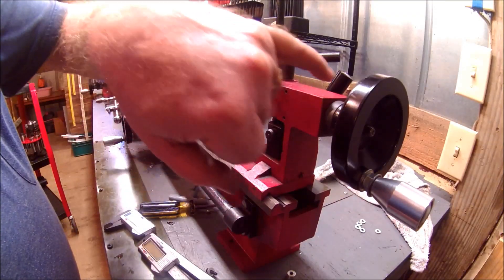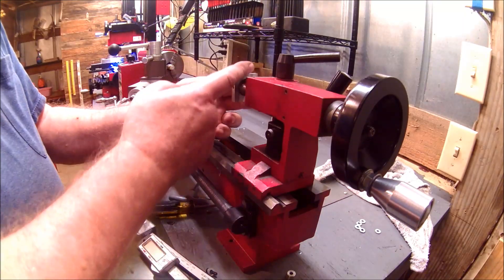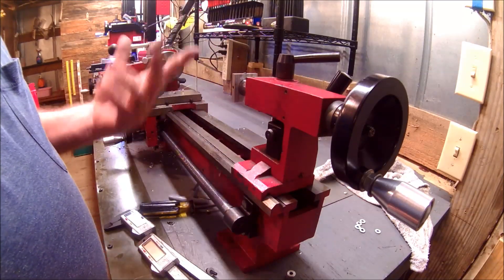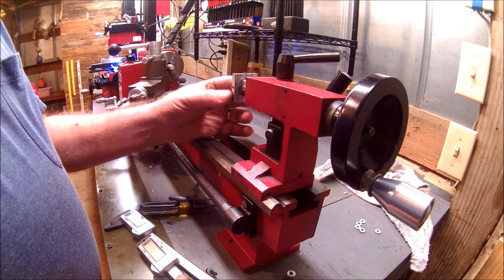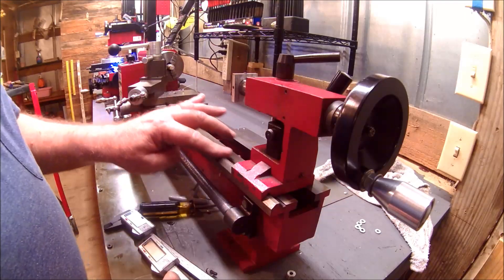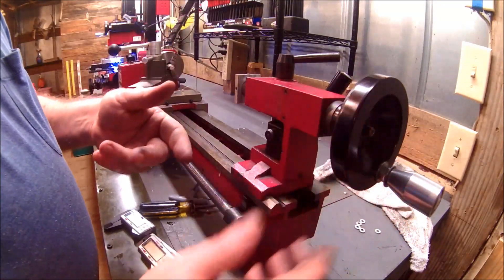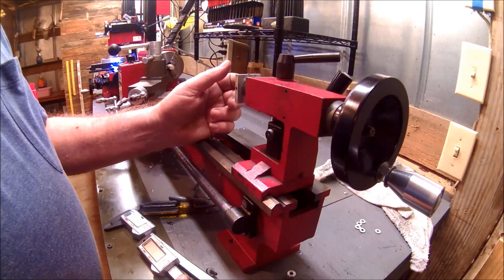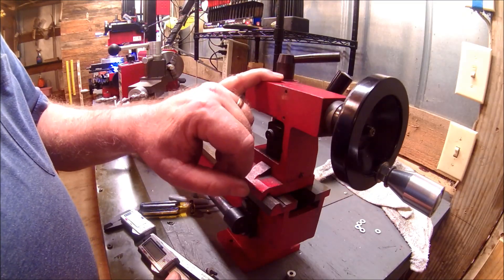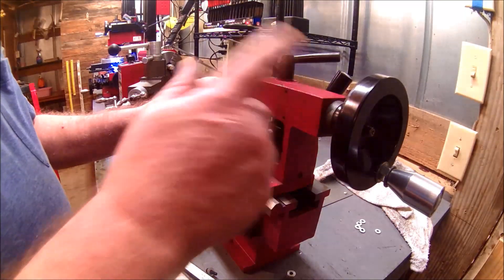What I did with the screw going in there: I took it out, drilled and tapped the end of that screw to make the ejector a little bit longer, because adding something onto the end of the quill meant you couldn't pull it in as far as needed to eject whatever you had in the tailstock. That worked for a little while until the screw backed out. I tried every kind of thread lock I could find, but pulling back on it put pressure on the screw to remove it. Left-hand thread might have made a difference, but it just kept backing out - and the last time it backed out it got wedged in there, and I literally spent a couple of hours getting it out without destroying the quill or the lead screw.